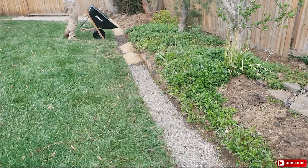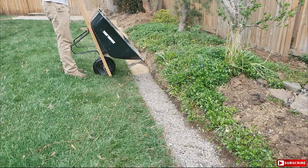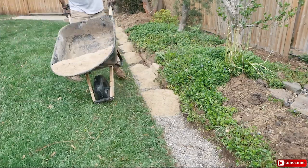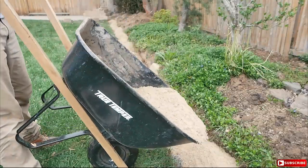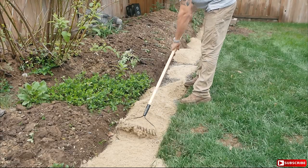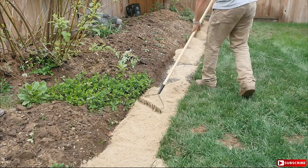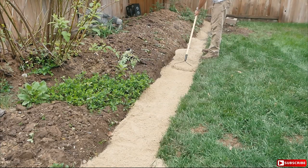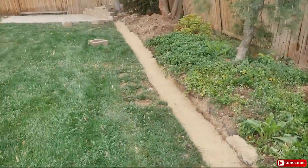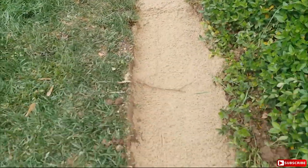For the next layer, you'll need to lay down one inch of masonry sand. The sand acts both as a bed, but also a tool to level each stone as they're stacked one by one. You don't need to make this area super straight and flat, so you can just use a rake to even out the area to prevent it from having high spots. Make sure you don't tamp this section down because you need it to be fluffed in order to actually seat the bricks themselves.